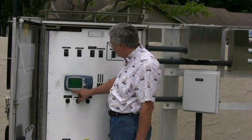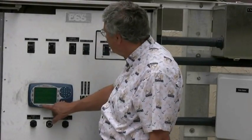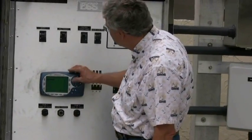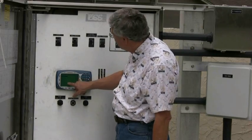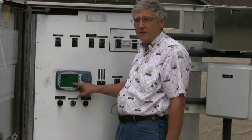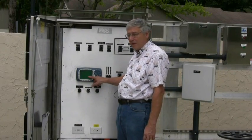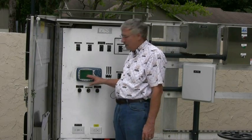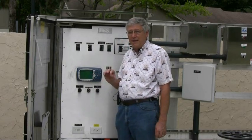I'm going to take a look at the Multismart first to show you the symptoms — the first indication that it's not working properly. Hit Info, then go to Power and Efficiency. After that you can look at the statistics and you will notice that there are dotted lines, indicating that no efficiency calculations were performed. The other indication is that if a pump is running you'll notice that there are no power factor readings.